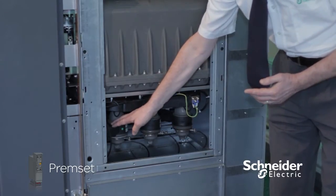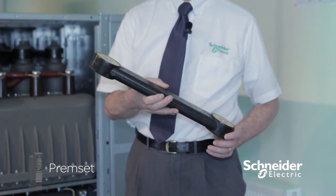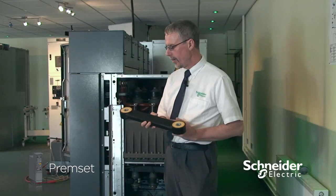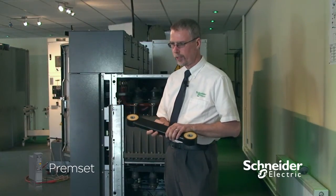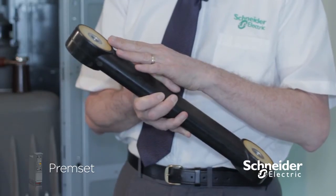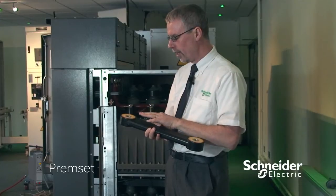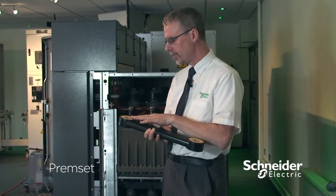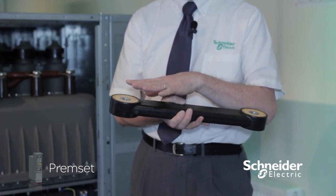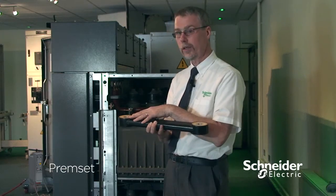Through to our bushings, we're using EPDM rubber with an earth screen on the outside. Our busbar is lightweight, using EPDM rubber with a conductive earth screen on the outside, making it unique in insulation property technology. It combines two properties: the primary insulation — the white part — and the black is our earth screen. When the busbar is bolted onto the vacuum bottle, it is compressed making primary contact with our conductor, but also squeezing the rubber down to ensure full earth screen continuity with the vacuum bottle.